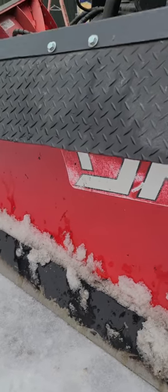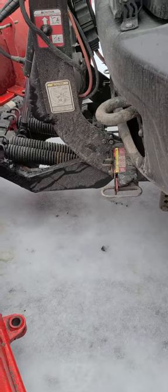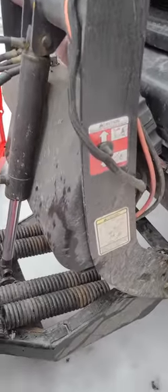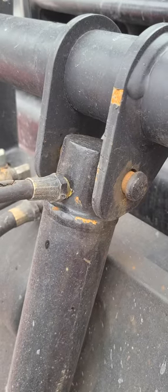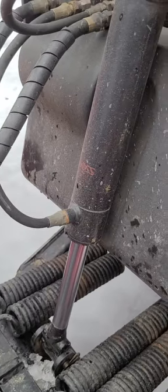Then I was out plowing and I found that I have a few driveways where I go over a hump. As I was going over these humps I thought the plow was just pushing really nice. Come to find out, when it was hyperextended — when it needed to be hanging over the edge of a hump — it wasn't touching the ground in float mode. I realized because the truck was lifted and the frame was three inches too high, I came home, put the front of the truck up on some blocks, and found that the plow wasn't going down far enough to float on those driveways. So I made an extension for the top, but it was too big — my plow just wouldn't lift high enough after I put that on, so I took it off.